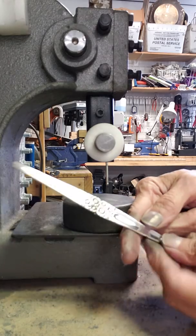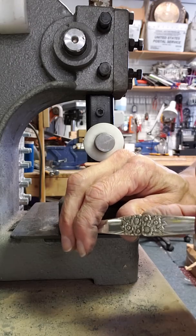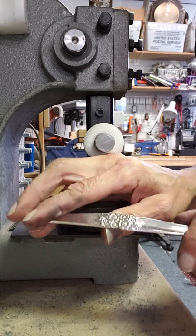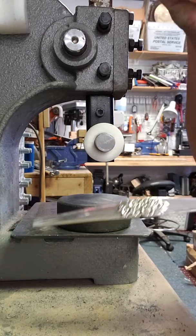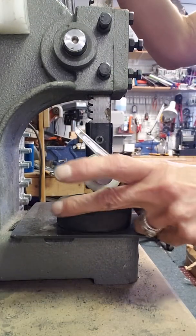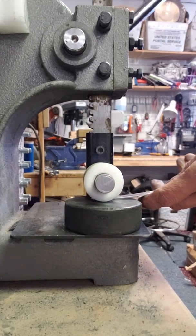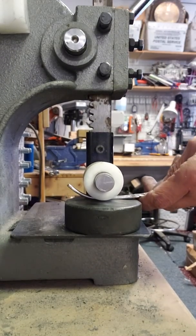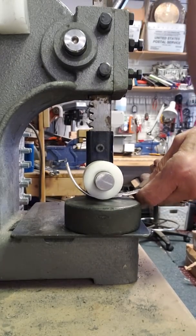Okay, we are going to bend the piece now. Now, as I suggested, I would give it a little bit of a flex to start with. Make sure that it's going to hold. Make sure you did your soldering properly. It's a lot easier to go back in and solder it now while it's flat, as opposed to getting a couple of the ends bent and then having it snap. So I'm going to start by giving a gentle curve to it with the roller on the rubber block. We're really focusing on curling the ends, not so much the middle. That's also going to help you to not accidentally break your solder seam.